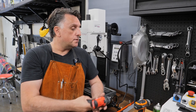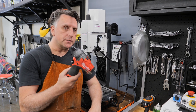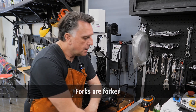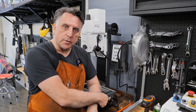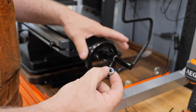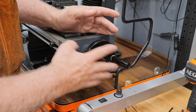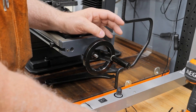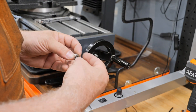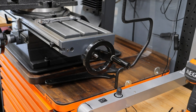Now we'll get on to the real meat of this video — how am I going to attach this to the handles on my mill without using a fork system or anything like that. I'll bring the camera down to this nut and show you what I did. First I needed to determine whether or not this nylock here had any kind of adjustment functionality in terms of setting a float. It doesn't — it simply locks the handle down onto the shaft. Initially I thought, wouldn't it be nice if I could get two nuts on there and tighten them against each other. Well that led me to the solution I've come up with.